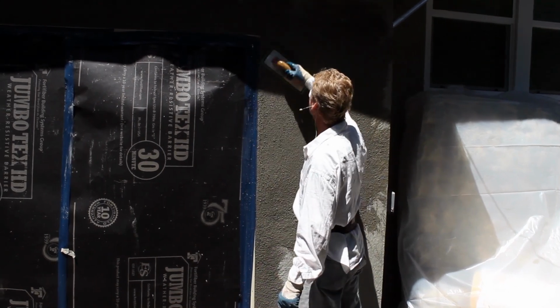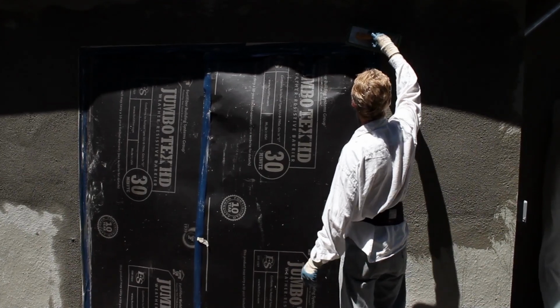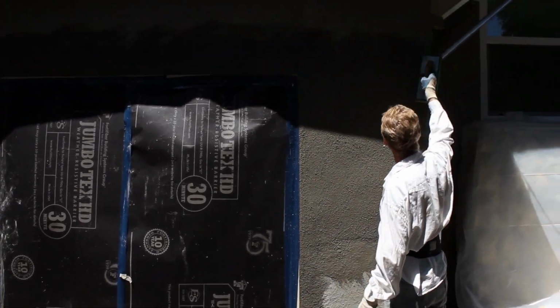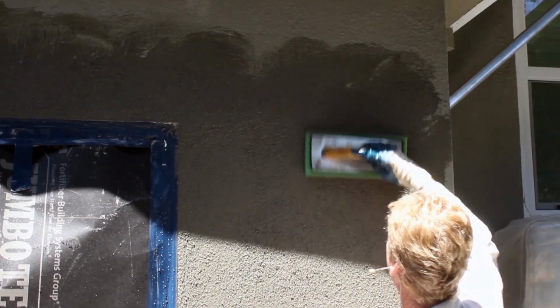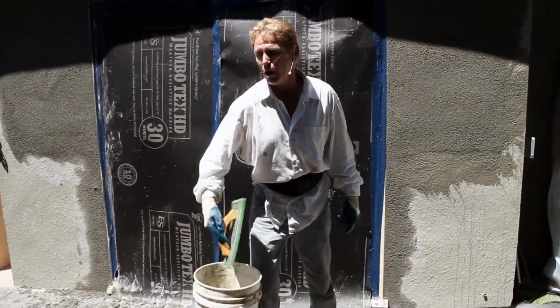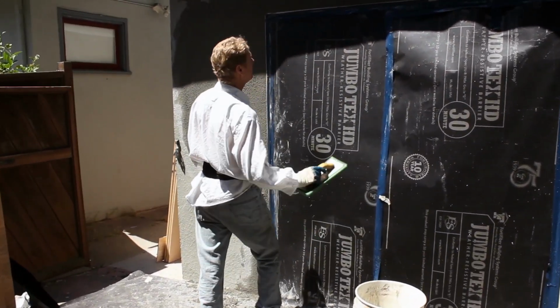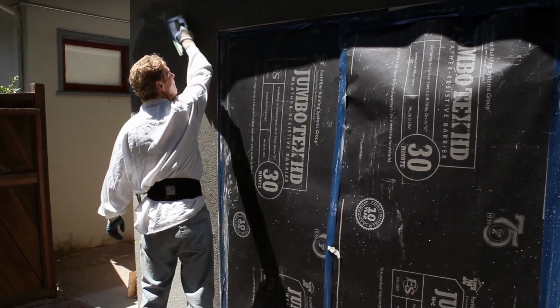Now I'm just going to go back and look at it once more. And if I've seen anything I did wrong, fix it now before I pull this tape. Now I'm looking at it a little tighter. So when I get to this stage, now I look at it with a critical eye. Okay, quit messing around. Is this about right, what they have? They have a float finish that's been painted about 10 times because it's about a 90-year-old house. So if I go super heavy, it won't match. I've got to get it to where 2 coats of paint, primer and top coat, will match this.